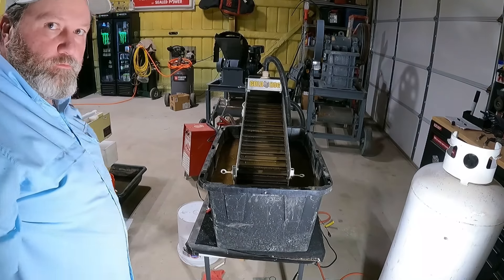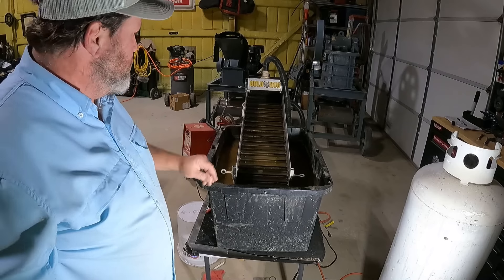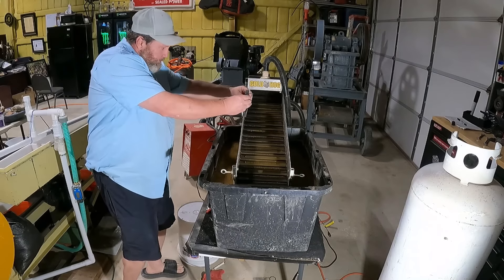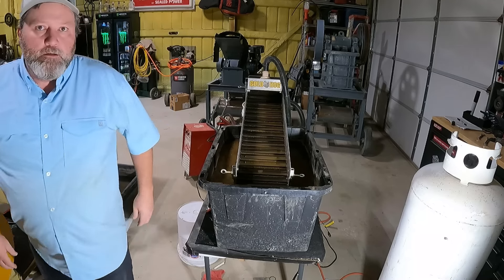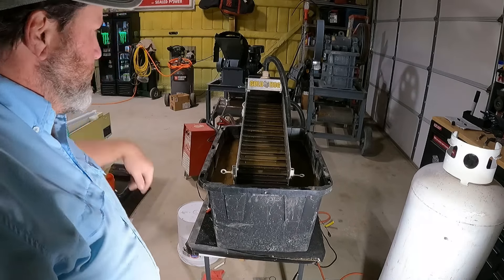When we know our material is fine gold, I just try to do a consistent, slow feed. This material is dry, so it makes it a little bit easier to do that. You can see the mat is turning the color of mud because it's level — it's the right pitch and the right feed. Every once in a while I'll let it run for just a second to let it clear all the way out, then I'll go to the next spoon.